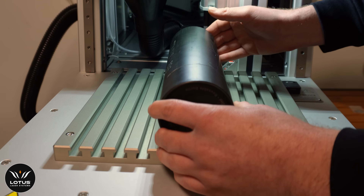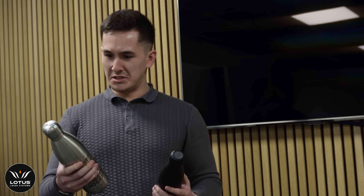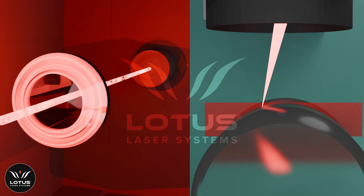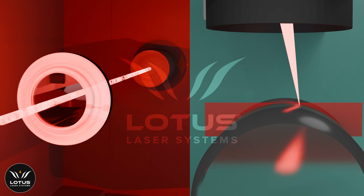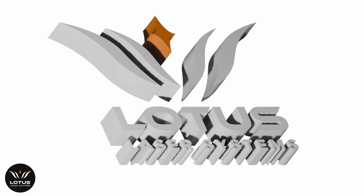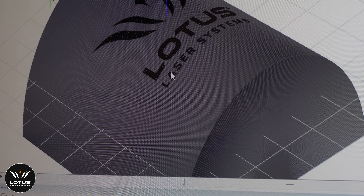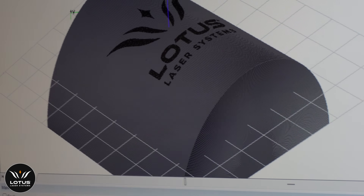There are ways of dealing with this — even as simple as putting the work surface directly underneath the laser rather than off to one side. Don't let anyone tell you you can put 4 or 5 bottles in a row and expect them to all mark the same. The middle one might be okay, but it's a descent into messy mediocrity thereon out. You can also make sure your focusing optic is putting the laser spot in the right place — this is why we treat your 2D logo as a 3D object. With a 3D model that's the same shape as the surface material, the optic actually knows where it needs to go next to get the spot size right and mark accurately.